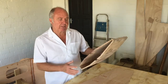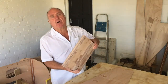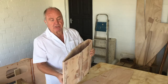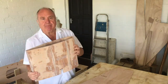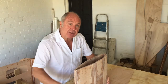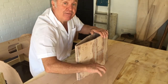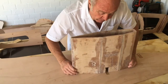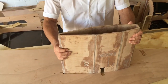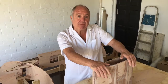The next component we built was the center board casing. With this you've got to take care because of the slope of the deck and the curvature of the hull — the sides are not parallel, so it's got a bit of a taper and you need to take care. What's very important is that you build this nicely so that when it fits into the deck board, the slots where the pin that holds the center board is lined up very carefully with the deck. We did a lot of careful planning and working to ensure a good accurate fit and that the slots are correct.